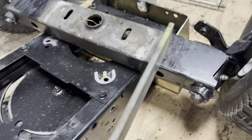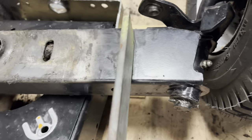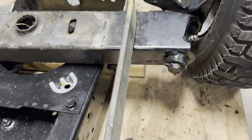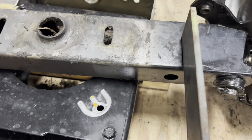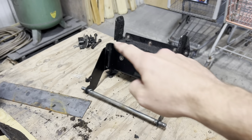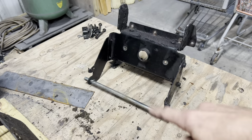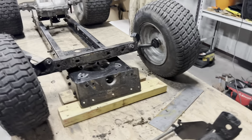And on the axle side, I'm going to take that same 1/4x2 flat bar, and I'll cut my axle tubing, weld the flat bar onto the center piece, and then slide this up and then weld it onto this bar. Then I'll put two gussets in the corners to keep everything firm. And theoretically, I should be able to trim down this other half of the pivot point, get all this bottom stuff out of the way, and still use my hood pivot. So let's start chopping it up and see how it goes.